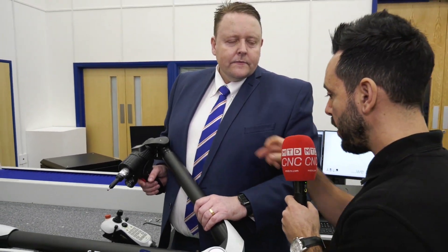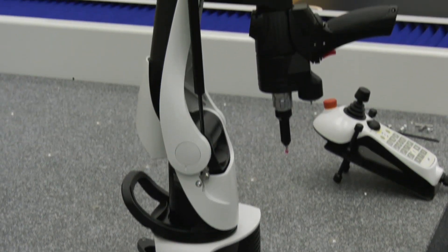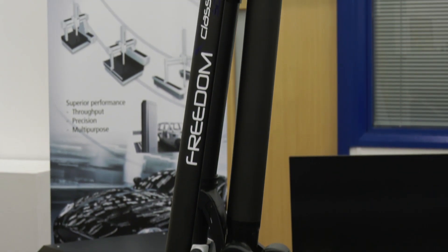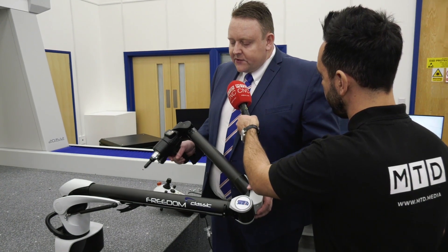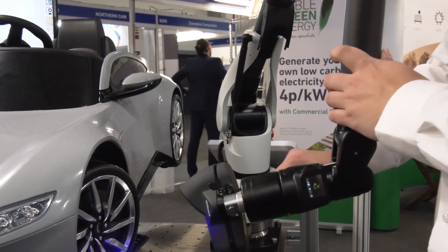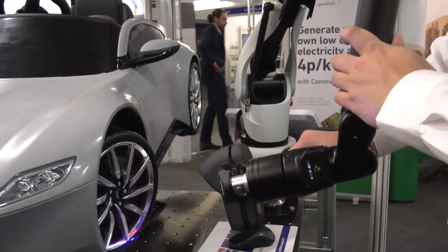You mentioned portable, but it's currently fixed to a CMM. Give me examples of its portability. At the moment you can see we've just got it clamped here to the CMM bed, but we can put it onto a tripod. We have a magnetic mount — if you've got a very large steel structure, you can put the magnetic mount clamped onto the side of the part, and effectively you could be hanging off the part taking measurements. So if you have a large cutout with a PCD of holes that you need to measure accurately, the arm is ideal for that.